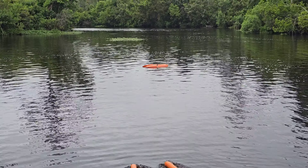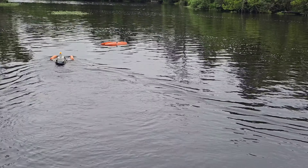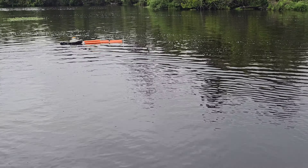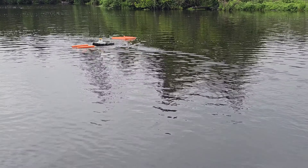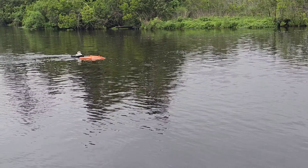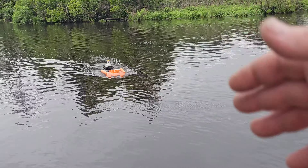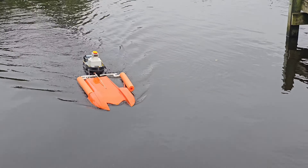With the CG aft she's gonna blow off the water. With that longer rudder we shouldn't have to move our CG back in the boat — it shouldn't have to be pushed back. Right now I'm running my CG back so that the back of the boat doesn't pick up and most of my rudder stays in the water with the extra weight back. Those were actually some of the faster passes I've been able to do with the boat, and with the two and a quarter inch setback on my rudder it does make a difference where your rudder is positioned.